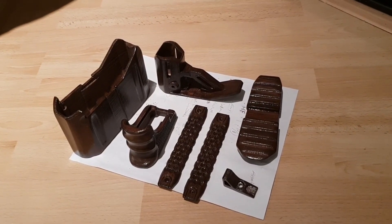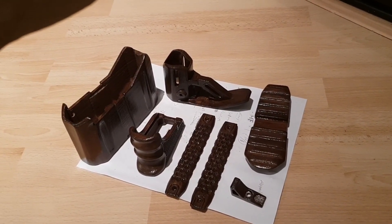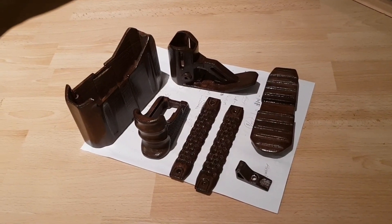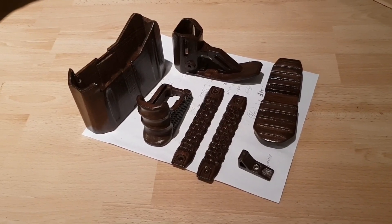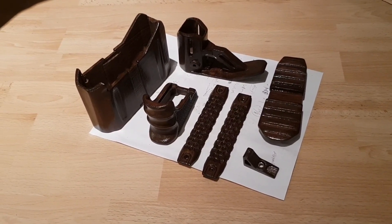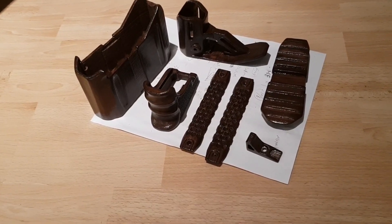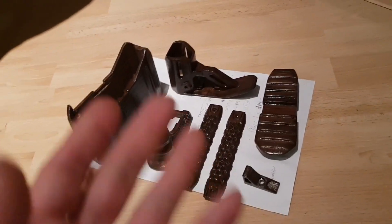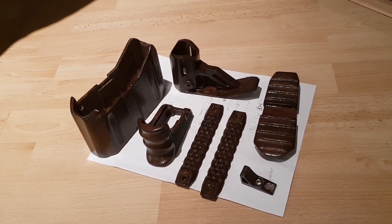Sanding is a lot of work, especially with so many corners here. After you sand it, you have to use what is called a tack cloth — it's like a rag but very sticky. After you sand it, there's so much dust still on the surface — even when you touch it you can't feel it, but it will show through once you put a new coat down. So it's a must to use the tack cloth to take away all the dust before you put a new coat on. But with four coats and so many corners and angles, I got lazy. I didn't do that.